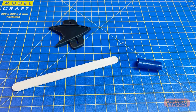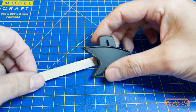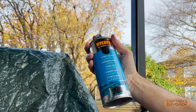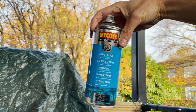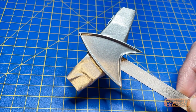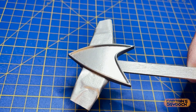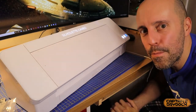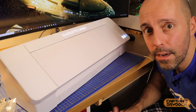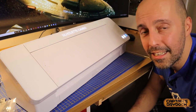For masking I use plasticine, which is cheap and easily molded. Lollipop sticks and masking tape are a great way to secure a small object and allow you to move them around freely when painting. What I forgot to film was washing the part in washing-up liquid to remove residual grease from handling, then hitting it with a dusting of gray primer and then matte black — as matte black is a great base color if you're going to be painting metallic paints later. The final colors that make this badge are aluminum silver and gold, so I decided to spray the silver first for the inset delta, and next would be the gold — but before that I had to mask off the silver.